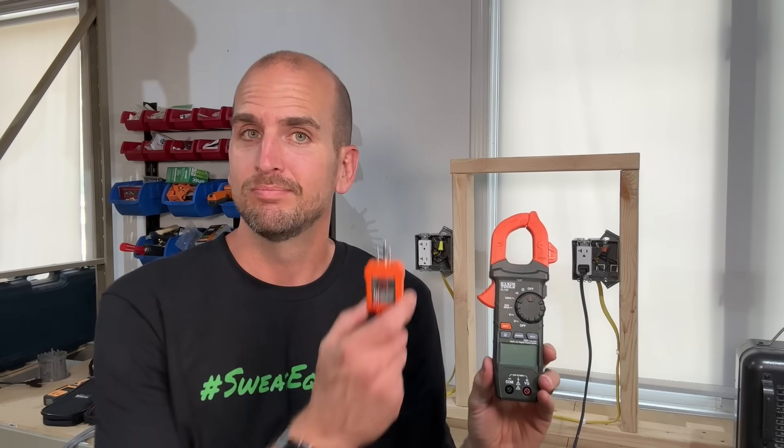But things have changed quite a bit, and what was once a kind of fringe piece of test equipment most DIYers didn't jump into — the clamp meter — is now kind of your one-stop shop. Between the outlet tester and the clamp meter, that is all you need as a DIYer now. You do not need a non-contact voltage tester and you do not need a digital multimeter.